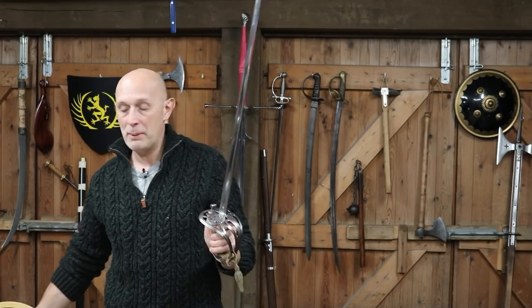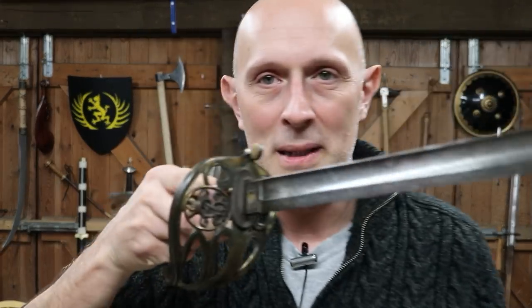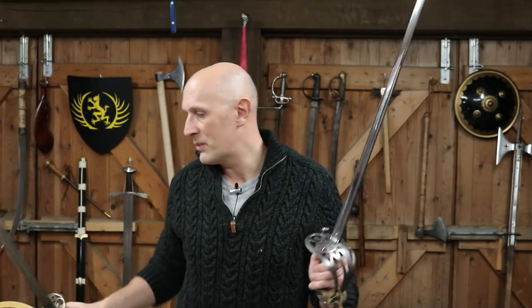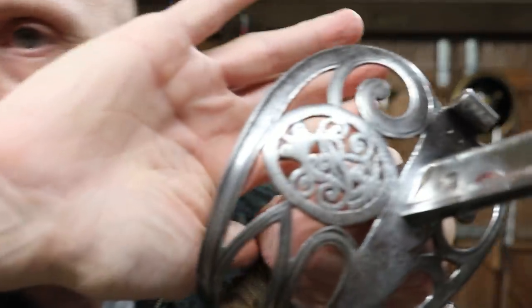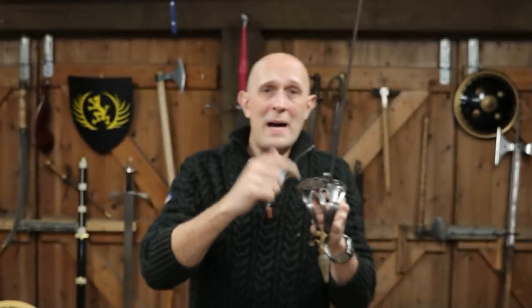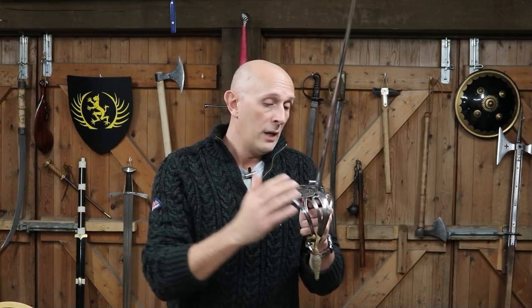How does this relate to the three-bar hilt? Well, quite simply, by looking at period production, this is a very expensive option. With a brass guard it's cast — you make one model by lost wax, make a mould, and then cast loads of them. Dead easy if you're a sword manufacturer. These steel guards, however, have to be individually cut, filed, and decorated. Look at that VR decoration in there — all hand-worked. The amount of man-hours that go into making one of these is far more than a brass one, so these were not economical. Obviously if you wanted to pay a lot of money you could get one, but they were very expensive to make.